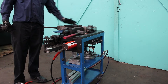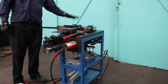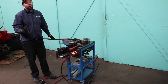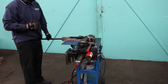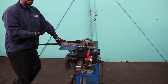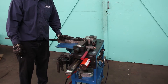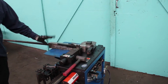I've set up our last set of tooling here — this is a one by one square tube tooling. This machine has many purposes: we can do inch and a quarter handrail, one by one square tubing, or maybe even two by two for cattle gates, horse gates, or things of that nature. Mittler Brothers is known for race cars, so we can do some tubing as well. I believe the Bigfoot monster trucks are built with this machine, or were at one point. I'm going to go ahead and bend this to 179 degrees — if you go to 180 degrees, you'll be in trouble.